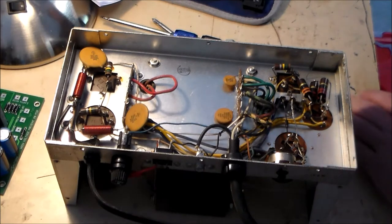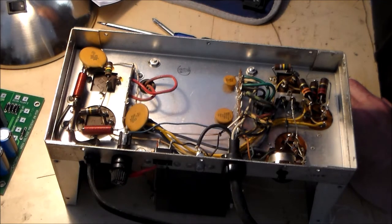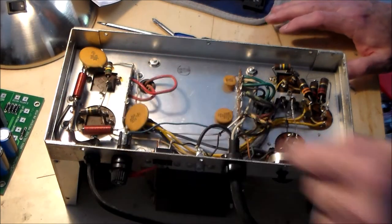Okay. So, next, cut the white-orange wire from the capacitor lead, capacitor on the left, with a 150K ohm resistor attached. This wire will be connected to the PCB later. Cut the white orange wire from the capacitor lead, capacitor on the left, with a 150K resistor attached. I think that is what they're referring to.